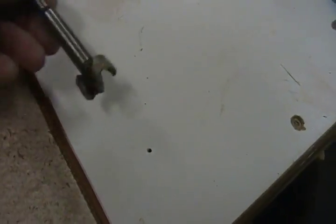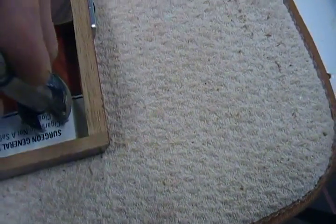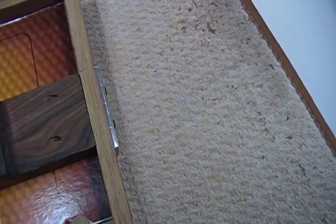The way to get around that is to plug the hole — and I didn't glue these plugs in, they're just flat plugs. You guys who have dealt with woodworking or furniture making know what a flat plug looks like: it's flat on top and bottom with a little bit of a taper. I just tapped them in with a hammer pretty much flush with the inside of the box. Then I'll find center on these, set it up in the drill press, go in and countersink that hole to where I want it so I have some threads poking out. Then I'll flip the guitar over, pop those plugs back out, push the pot in, and I'm all set.